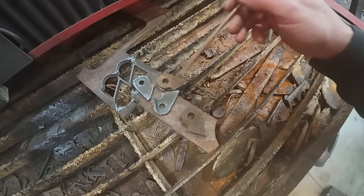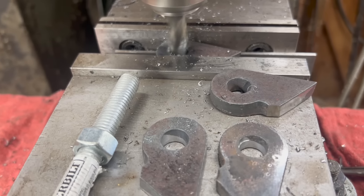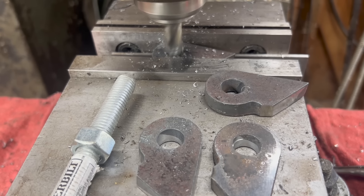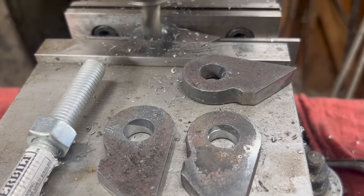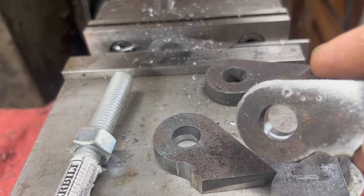I'll clean them up and get them in place. After sanding the pieces a little bit, I bring them out to the machine shop just so I can bore a perfectly clean half-inch hole. Plasma cuts when you make small holes never come out really good — you're always going to need to bore them out a little bit.